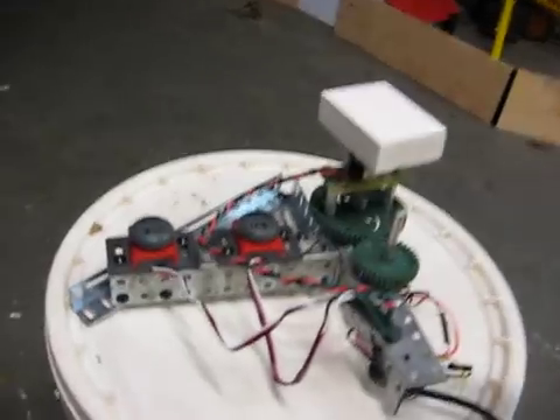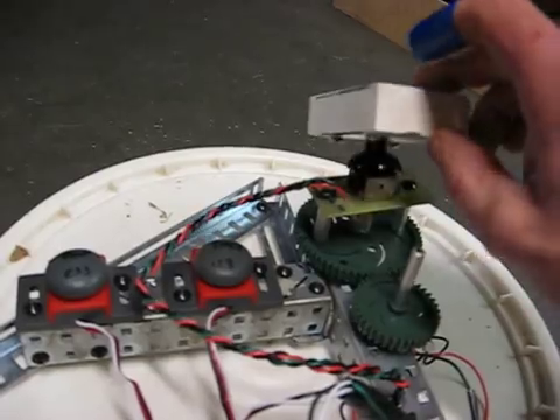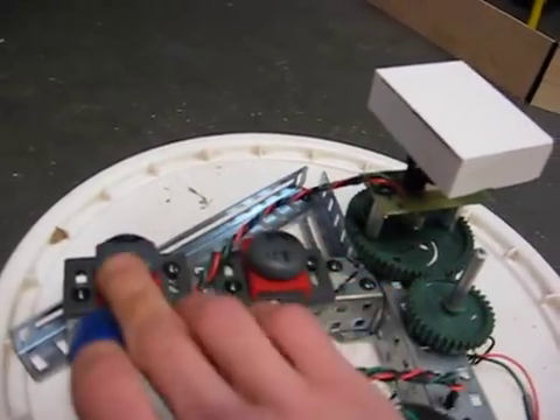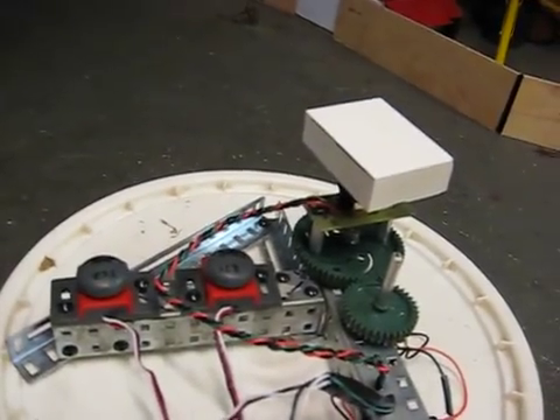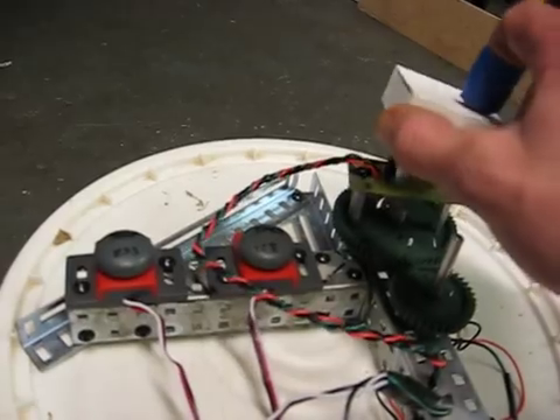I built a new encoder for encoding head moves. I've got a little joystick there, and start and stop buttons for starting and stopping the recording. This is to record head moves onto my E-Proms, which can be played back — I'll show you in a second.